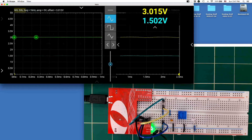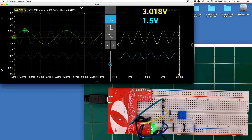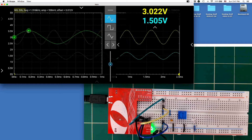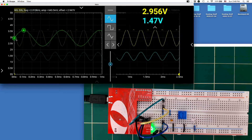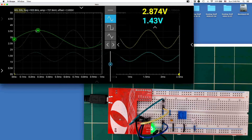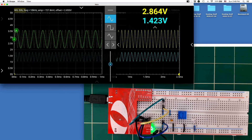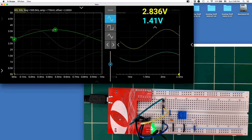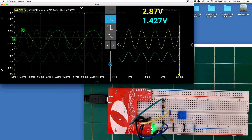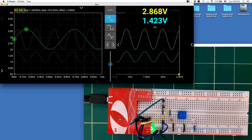I can change to a sine wave. Now I have a second control point that lets me adjust the amplitude and the period of the waveform relative to the offset. I can move the offset up and down, and I can adjust the period to put 10 cycles in the view or as little as a quarter cycle. The left and right arrow buttons also let me change the frequency in coarse steps.